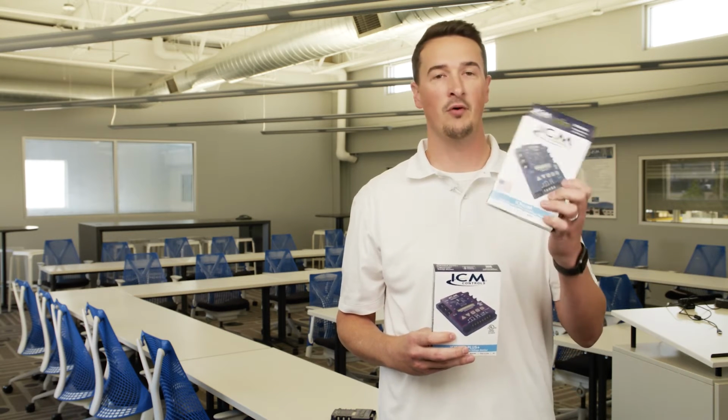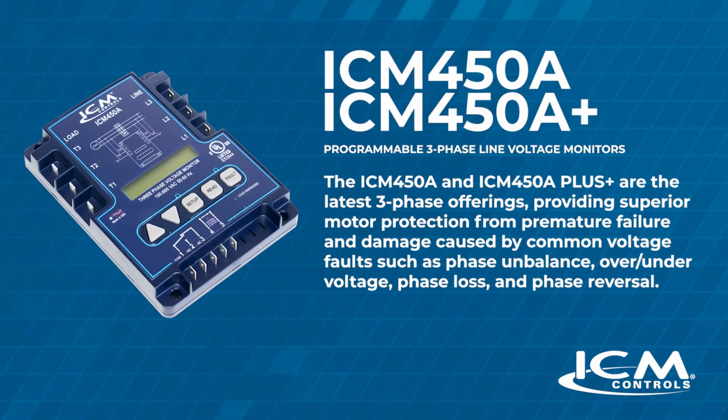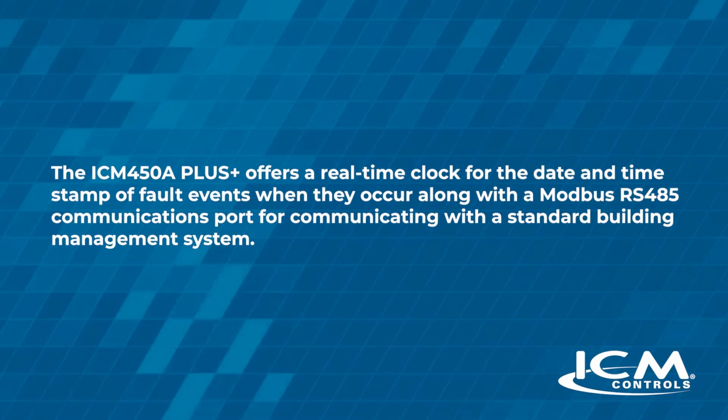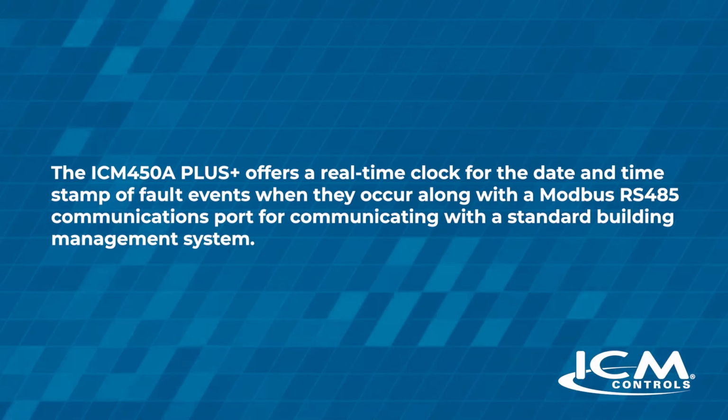Today we're going to be introducing you to our three-phase programmable line voltage monitors. We offer two models here at ICM, the 450A and the ICM450A PLUS. Both offer superior protection for motors and compressors by monitoring for under and over voltage, voltage unbalance, phase loss, and phase reversal. The differences between the two models is that the ICM450A PLUS offers RS-485 Modbus communication ports, and it also allows for real-time and date stamping.